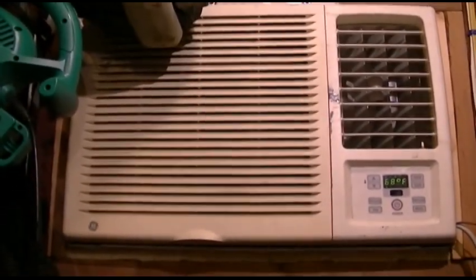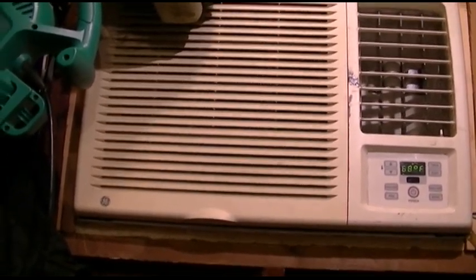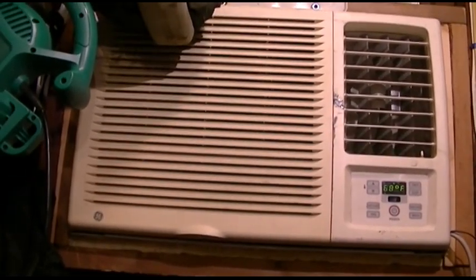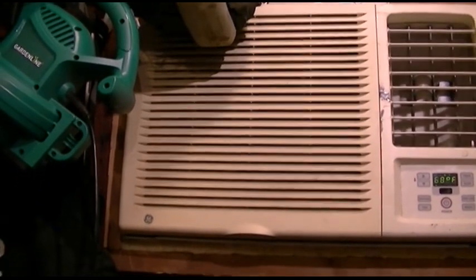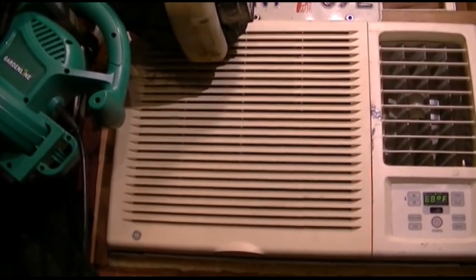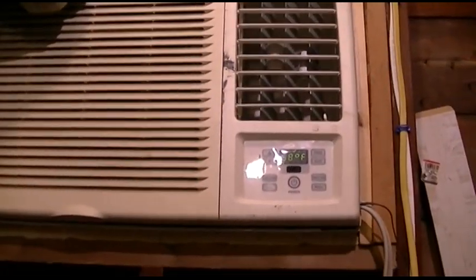Low also follows suit. You may save 40 watts on the fan, but you have even less airflow, and chances are very good that the reduced airflow is going to lead to increased pressure in the system. That will also make the compressor work harder, driving that wattage right back up. So you're not saving any electricity that way.